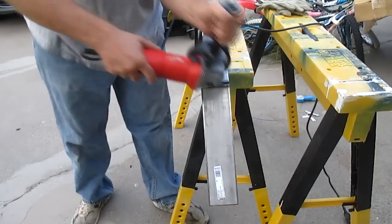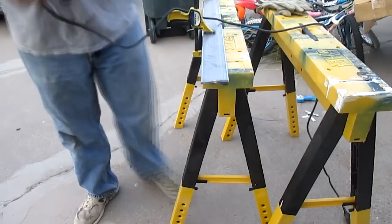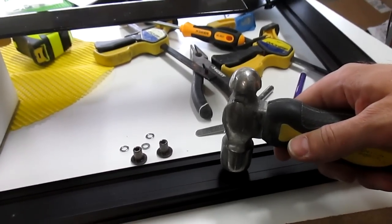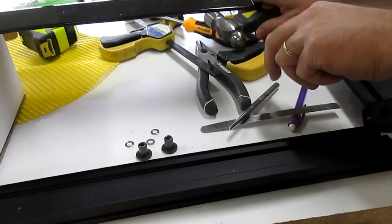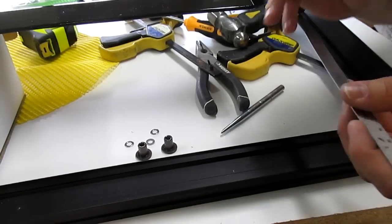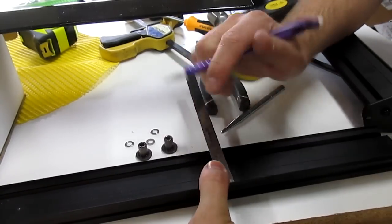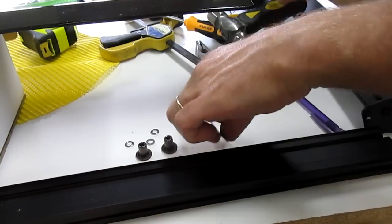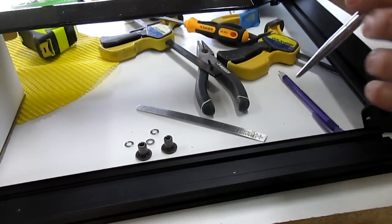You can mark with a pencil and it'll come right off if you want to remove it. You can use any number of bolts to hold the steel in place. I chose to use 5, so I marked my holes starting in the middle and then put them about every 6 and a half inches apart. I centered the holes half an inch above the lip on the bottom of the maker slide to prevent interference with the upper slot.